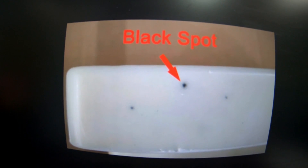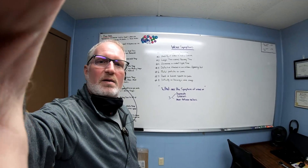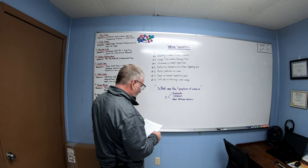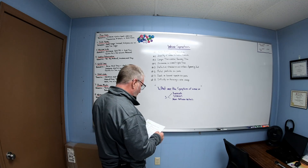Here's a picture of black specs in a part. Regarding screw rotation during injection: worn or damaged non-return valves or barrels allow the screw to move forward without pushing the plastic, causing the screw to rotate.